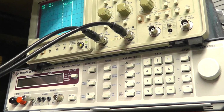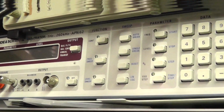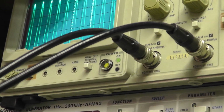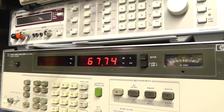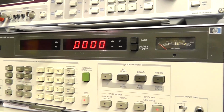Let's wind this back up again. There we go, just off the clipping again. On the onset of clipping, it's making about 73, 74 watts. Just into clipping it's running about 78 watts. So clearly making its specification no problem at all.